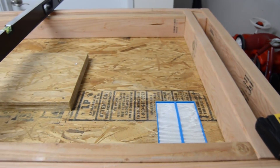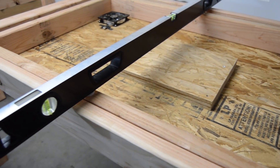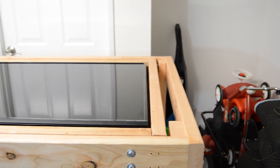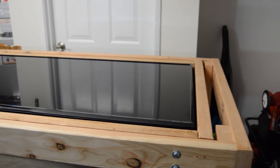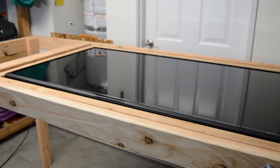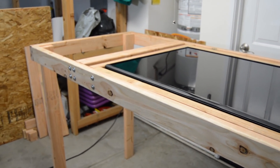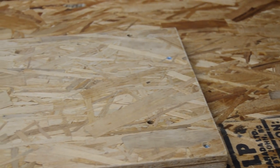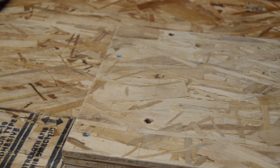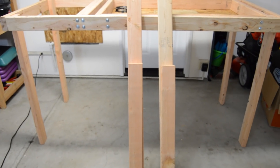I then screwed the bottom of the TV cavity onto the tabletop frame. After it was installed, I also screwed three layers of 3/8-inch OSB to the center of the cavity to function as a spacer for the TV, so the screen will be right underneath the glass. I carefully planned the size and location of these spacers so I didn't block any vent holes on the back of the TV. With the bottom of the TV cavity complete, I laid the TV in to check its fit for the first time, designing the cavity with approximately a half-inch gap between the TV and the sides.